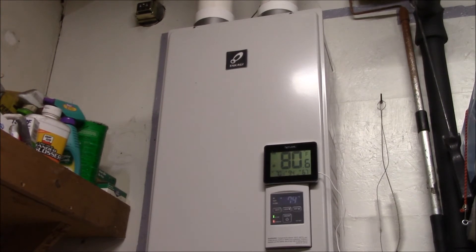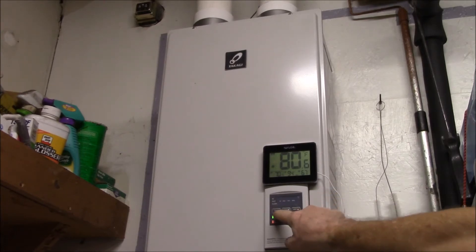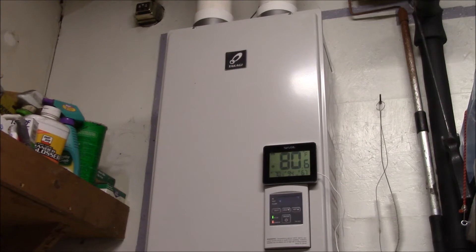You'll notice the displayed outside temperature is warmer than the indoor 70°F — it's 81. I'll turn on the hot water here in the utility sink. There's our incoming water temperature; it's summer here so we get pretty warm water, 74 Fahrenheit. I'm going up to 140, so this should read 140 pretty soon. Now let's look at the gallons per minute.